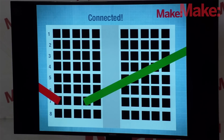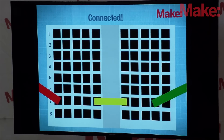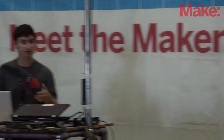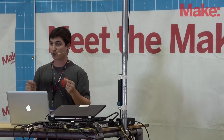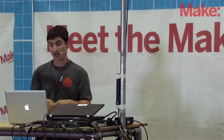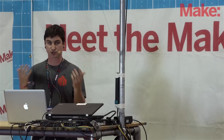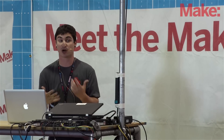If we wanted to connect the left-hand side of the breadboard to the right-hand side, you could also do this kind of configuration. Here we have the red wire plugged into row seven on the left-hand side. We're using a yellow wire as a jumper to bridge across the two connections, and then the green wire is likewise on the right-hand side. This would also be a complete connection to whatever you're wiring up.